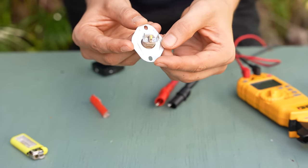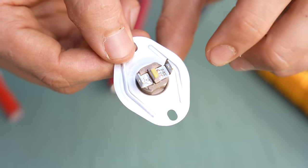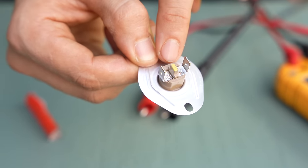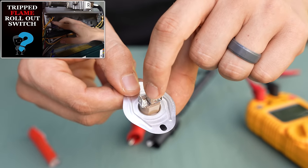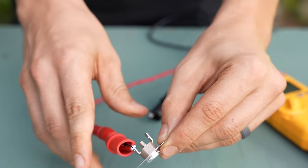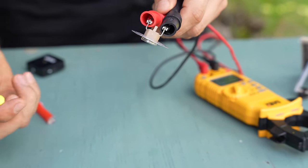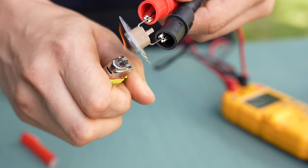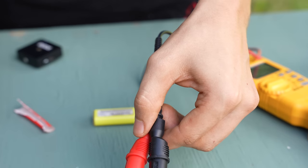The next switch we have is a flame rollout switch, which is also a limit switch, but unlike the other two, this is a manual reset. So if this one trips, it will not automatically reset — that's why there's a little button up on top of it. The flame rollout switch does not automatically reset because oftentimes if this thing does trip, that means the furnace heat exchanger is likely bad. They want you or a technician to look at the furnace before the switch is reset and the furnace continues to run. So it's the same limit switch, but manually resettable. I'll overheat this one and we should be able to see the button pop up a little bit — and it tripped. No matter how long I wait, this one will not reset.